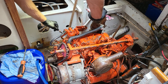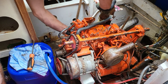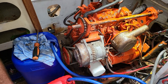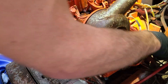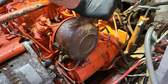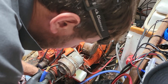It's just over the full mark and the engine oil colour's really good — that's good. The gearbox oil, I've got probably about 15 mil over the full mark, which I'm pretty happy with. It's just going to splash around a bit more and help flush that out. When you do a couple more oil changes, use whatever oil you put in there — basic engine oil — and just flush it and pump it out with your hand pump. You switch between engine and gearbox with a lever underneath — you turn the lever one way or the other. Your engine oil will be the clean one and the other will be the grey one.